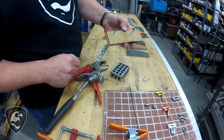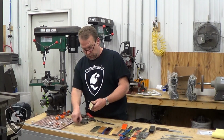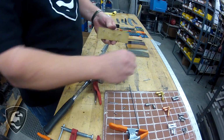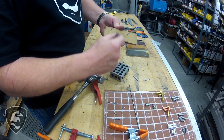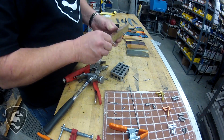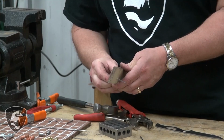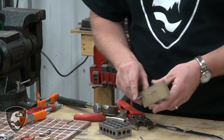Those 2 holes that we have remaining right here. We're going to enlarge those with the next larger size drill bit so it's not so tight. Then we'll put pins in there and we'll re-drill those holes, and then we're going to come around and countersink on here for the corbies as those fit in.